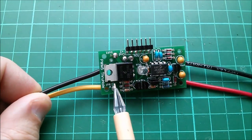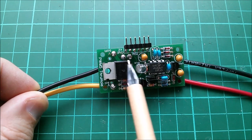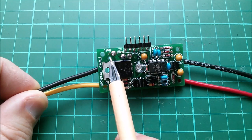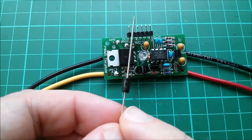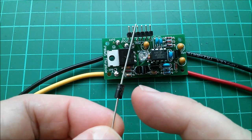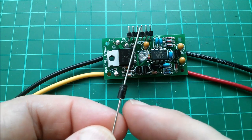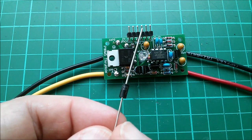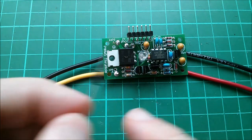The only thing insulating the tab of the MOSFET from that connection track is the solder resist coating. Is that good enough? It probably is if I don't scratch it, but it's quite thin. Once the transient suppression diode is soldered in and the UV glue conformal coating is applied, that'll glue everything into place so the MOSFET won't move. Here's the component - it's the P6KE33CA. The CA type is bidirectional, so there's no cathode marking - it has two anodes, effectively two zener diodes pointing at each other.